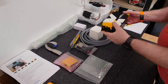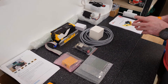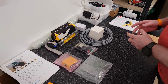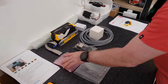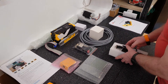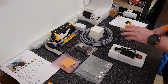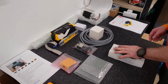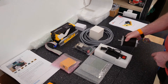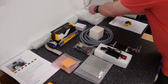So the stepper kit — the guys at CNC for You have put together a complete kit available online for the Warco conversion. It pretty much includes everything you need with the exception of the motion controller. The one I've got is equivalent to the pro kit; they also have an ultimate kit where all the steppers are the four-and-a-half newton metre ones. But Brian reckons if you've got the four newton metre steppers for X and Y and a four-and-a-half newton metre for Z, you're good to go.